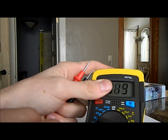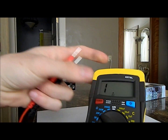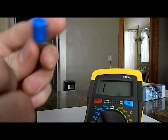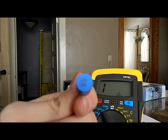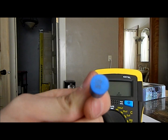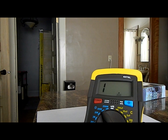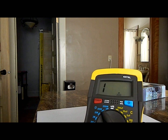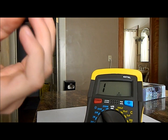First we're gonna start off with a 100 microhenry inductor right here — just a choke coil or something, I think. It's 100 microhenrys. So I'm gonna test it and here we go. 98.8 — that's close enough for me to be happy. That's closer than the 10 microfarad capacitor was. We got that one.